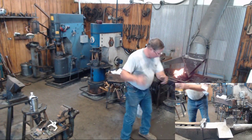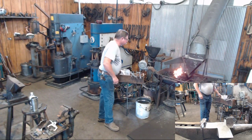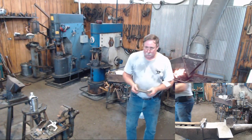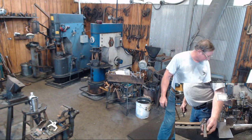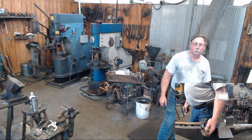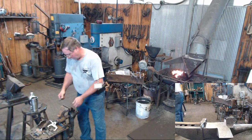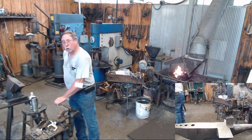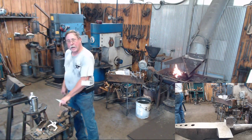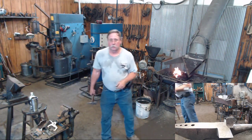All right. Another little tool that's real handy when you go to make tenons. This is a monkey tool. It was just a 3/4 inch block of mild steel that I drilled a 3/16 hole in. Okay, so what I'm going to do is bring our upright out, lock it in the vise, stick this monkey tool down over the end of it, and drive it up into my mass. That's going to produce a square corner, which when you're joining two things together, you need.